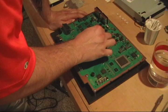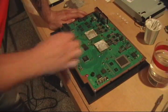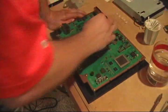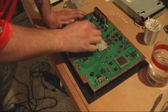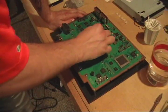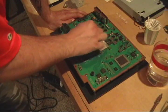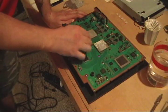You know, you're going to need an air compressor. You need to blow these things out. I've seen people reflow these and not blow them out. I get customers bring them to me all the time. Been reflowed in the past. The person that reflowed it didn't even clean it out. I even had a customer who previously sent it to that RSI company bring it to me within a couple weeks of getting it back from them, and they didn't blow it out. It just baffles me. So once you get the edges clean, clean your top.